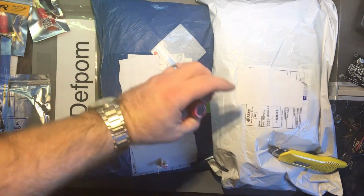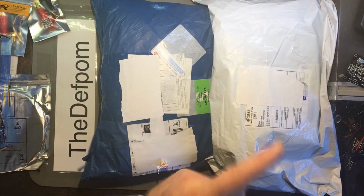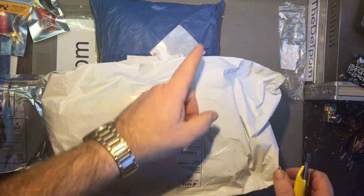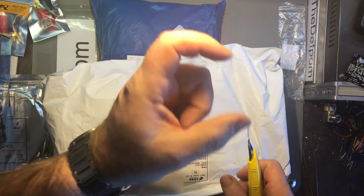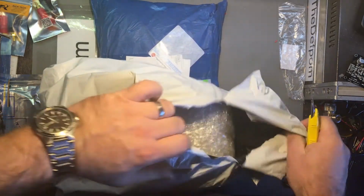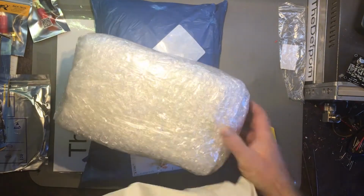Who knows? So anyway, I've at least got the final capacitor I need to finish doing that Fluke now. I think I've actually got all the parts I need to finish the Fluke. So I'm not showing that on video yet. I may or may not video it. All I had to do was replace that final capacitor and change the binding post on the front. It still has other little electrolytics in there, but they all tested fine. So any weird values, I'm just going to leave those alone for now. It's working fine. So this is just for the sake of completeness, changing those capacitors.